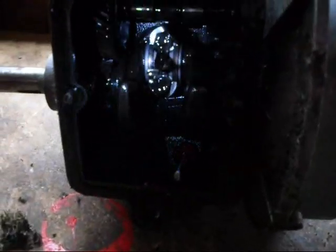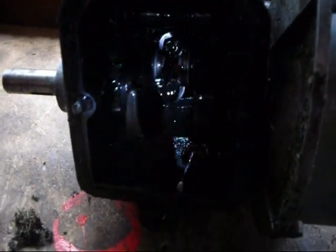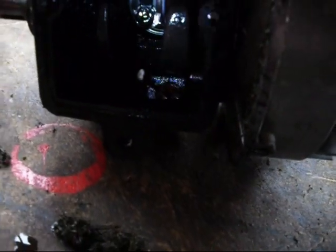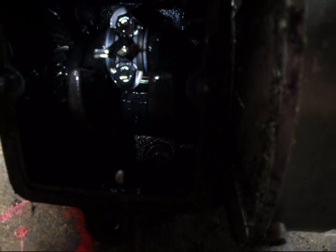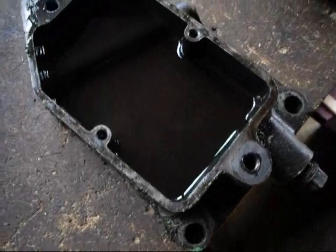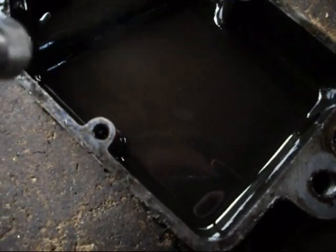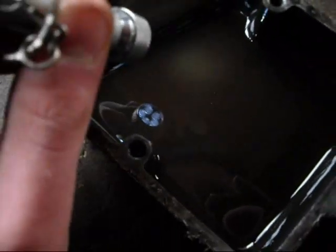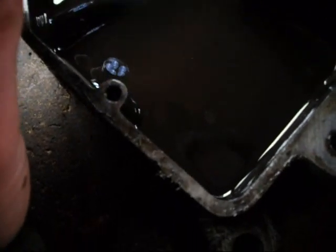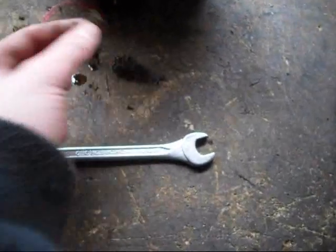I think this has probably been serviced a few times in its life. Looking inside with the torch - it doesn't look bad in there. There's the crank, big end with the oil dipper, camshaft across there, and the gears - it all looks very good. But I have a feeling the big end might be a bit knocky. Most of the oil has drained out now and I can see lots of little bits of metal. It looks like bronze, so that says to me that the little end is probably quite worn - I suspect that's the phosphor bronze bushing which has broken up. I'm going to wash this all out with paraffin. They're very robust engines, these will take tons of abuse.